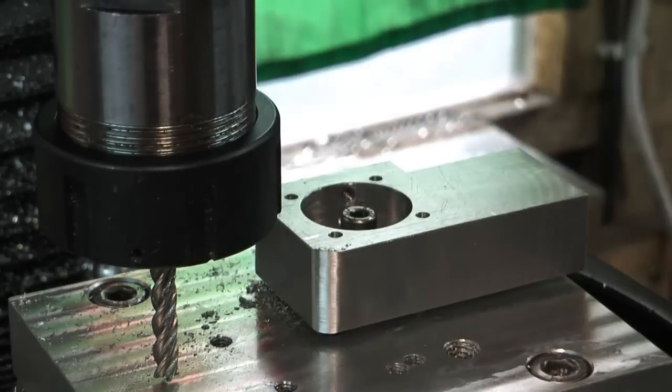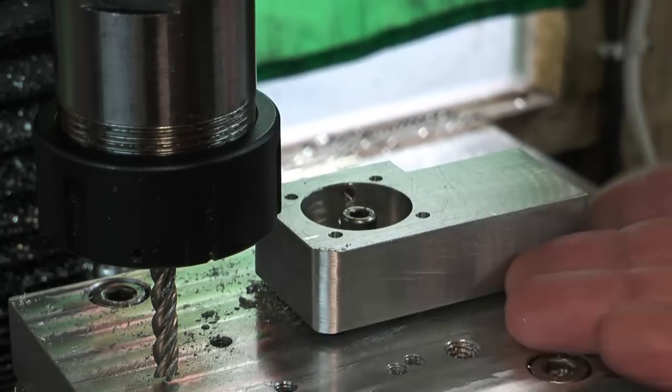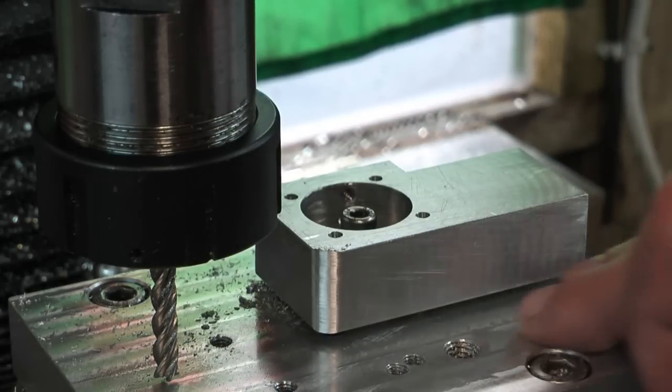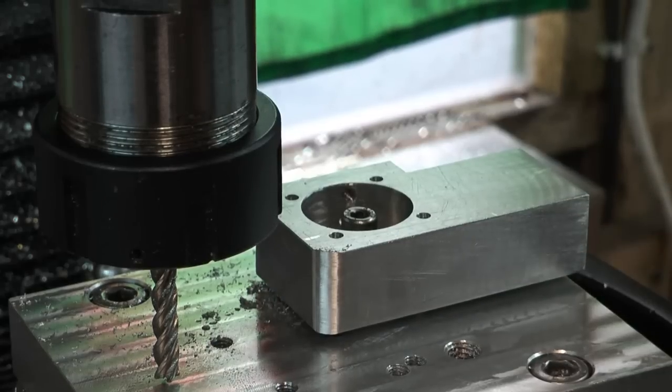That's rads on all the corners of all the bits and pieces where they had to be. They weren't shown as compulsory on the drawing, but it was optional and we want to make it look nice, so I've done them. That's enough for today — I think that's most of the rotary table work done. There will be some more when we come to the crankshaft, I'm sure.